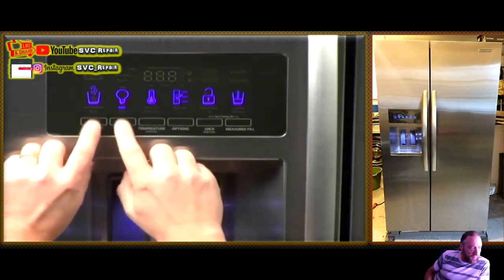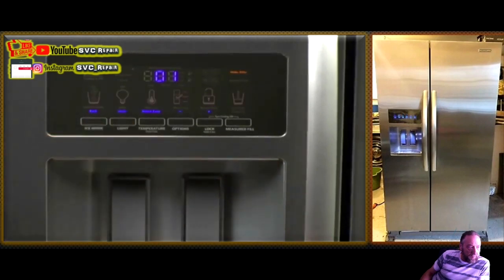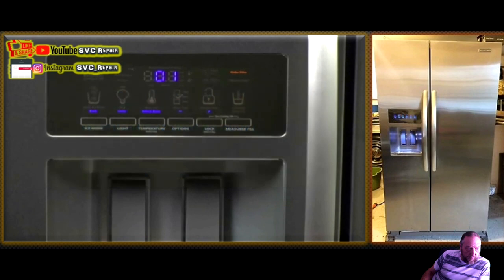Important: the unit must not be in lockdown prior to entering service diagnostic mode. To enter, press SW1 and SW2 simultaneously for three seconds; release both buttons when you hear the chime. The display will show '01' to indicate the control is in step one of the diagnostics routine. To exit at any time: press SW1 and SW2 simultaneously for three seconds, disconnect from power, or allow 20 minutes to pass. Each step must be manually advanced by pressing SW5.